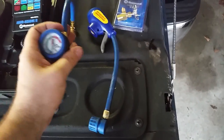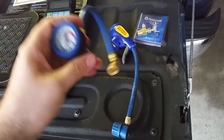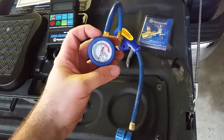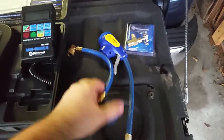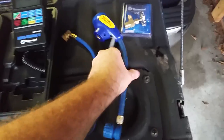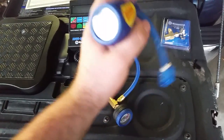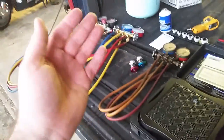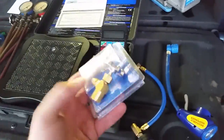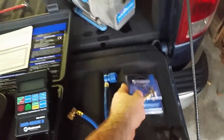These are your little quick-charge hoses — they come with the little cans you buy at AutoZone or O'Reilly's. If you really want to use these quick-disconnect hoses, they're great if you're in a pinch or on a trip and don't have your gauges. I don't really like using them though — I know how to read gauges so I prefer my manifold gauges. That's why I bought this can tap: I can put it onto a can, hook my gauges up to it, and read the pressure, which is what I'm going to jump to next.